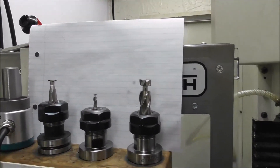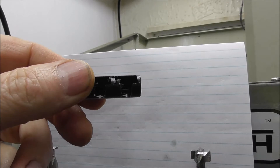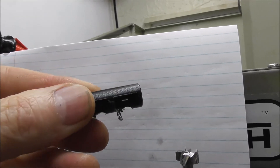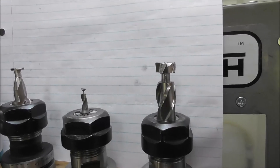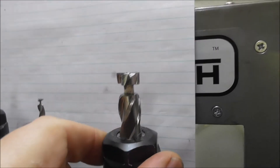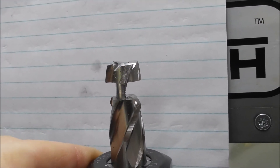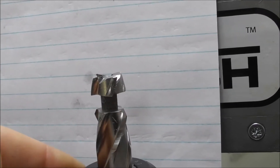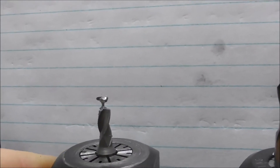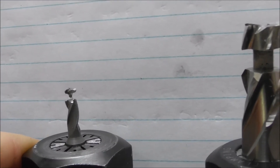While covering this frictional workholding, I'll touch on these cutters. If you've got a part where you want to machine the vertical face and the horizontal face in the one setting to save changing your part, you can sometimes do that with special types of T-cutters. I just ground these freehand on the bench grinder — you can grind an end mill into a T-shape with a D-slot in the middle, allowing it to cut like a full T-cutter. This very small one was ground out of a blunt 4mm end mill.